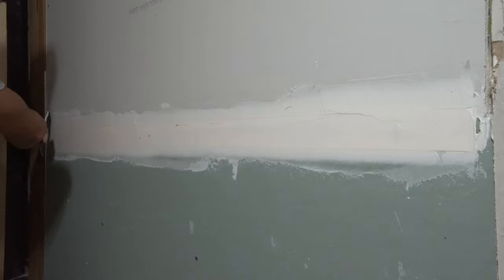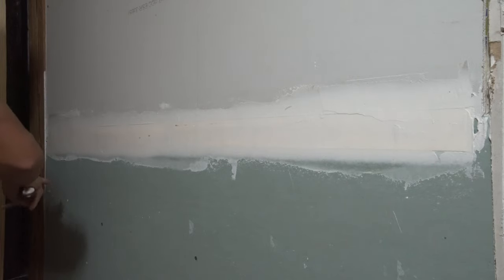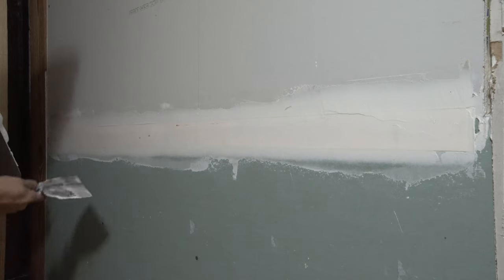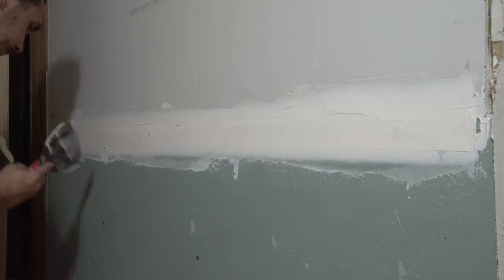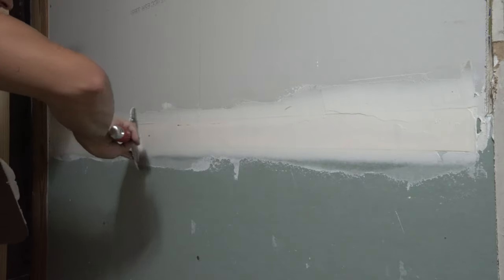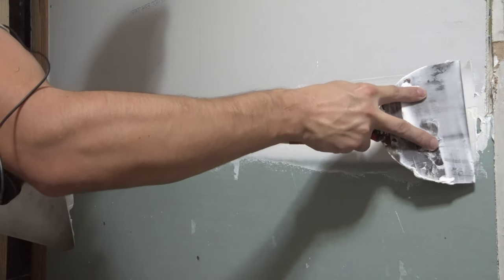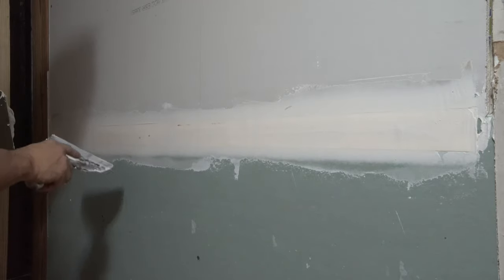This will make sure you don't have to do nearly as much sanding. I have one little mess-up — a very low spot — so we're just going to take a little bit of mud and fill it in, not the end of the world. That's it, that is our first coat. We see we've got some high spots, and it looks like a little bit of a high spot here. We can try to work on that, but it's fine because we do have to come back and put more mud on.